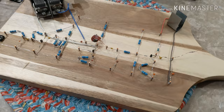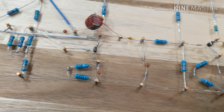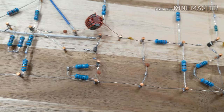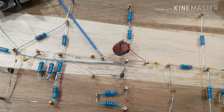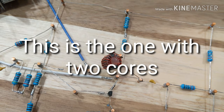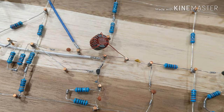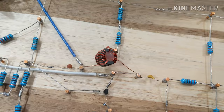We're back to the breadboard and as you can see I've made a little bit of progress since last time. I've got the paper all ripped off, I've got all the caps in place — my parts had come in. I also got the inductor in place — the dual inductor actually. My LCR meter finally came in and the value on the inductors came out right around 170 microhenrys. Everything is wired in.